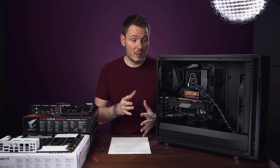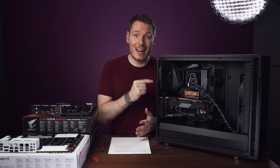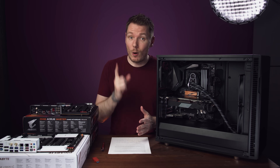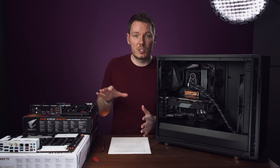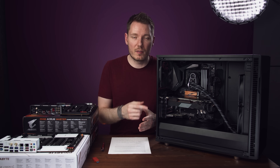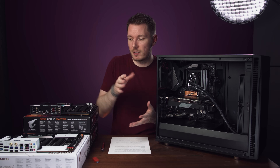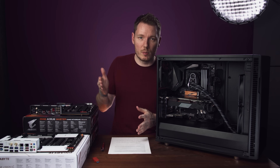What I can say after having built all of these back to back is that the experience was pretty much the same once you get into the BIOS — the setup and menu layout are the same across all three boards, everything is easy to find. My overclock of 4.35 GHz on the 3900X was maintained on all three boards with no issues. And when you actually get into Windows, there were no driver issues — the devices are all close enough that it was seamless with no driver conflicts between the three boards.